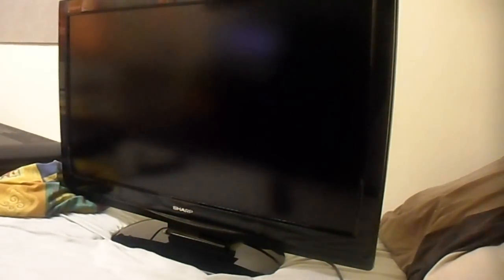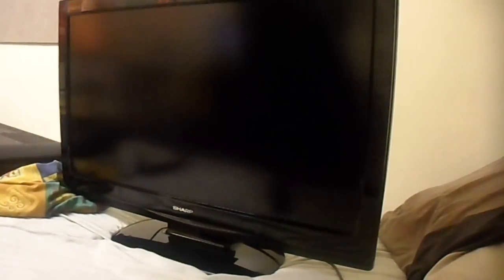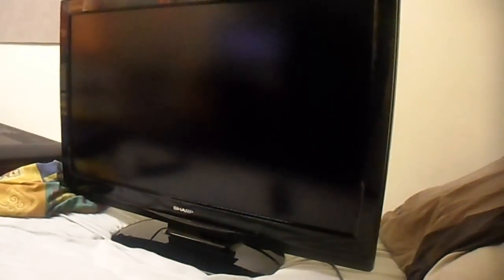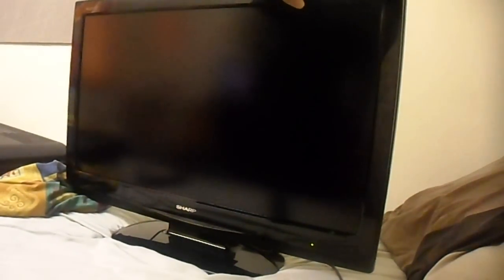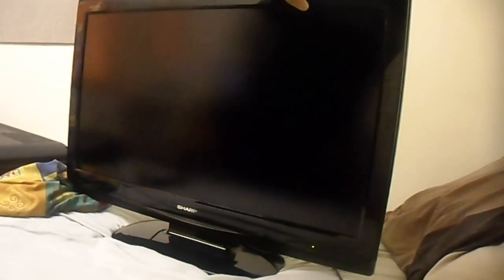After you've done that, the TV will still appear to be malfunctioning. What you'll need to do is go into the service menu service default mode and reset it - done exactly the same as before: volume down, Input, Power. Hold these - it may be a little hard to hold them because the case is unscrewed, but keep holding until it powers up into service default mode. It's very fiddly to get into this mode.